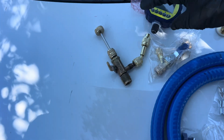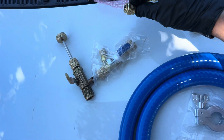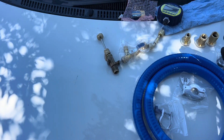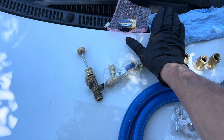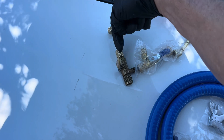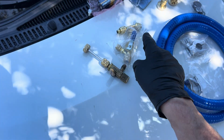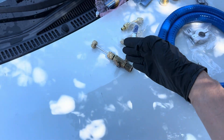You're supposed to have this because you don't want refrigerant and oil to get up there. This will go right there, then this goes into the end — and this is your ball valve for shutting it off. When you're ready to recharge, you don't take it off — you don't want to risk getting air sucked in. You just ball valve it off. Now your micron gauge is separated from the system, and when this is removed you unthread it and your refrigerant charging hose goes right here. Put it in the off position — that isolates and protects it so no refrigerant or oil can be pushed back up into the sensitive sensor, and you complete charging your system.